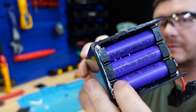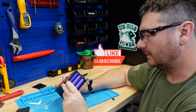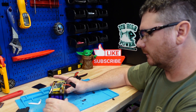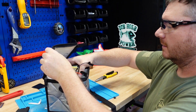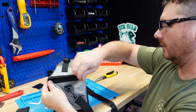There appear to be some heat marks on the bottom of these cells. Yeah, this thing got really hot, really fast. The BMS didn't do its job. I'm going to put this in my fire bag and properly dispose of this battery.